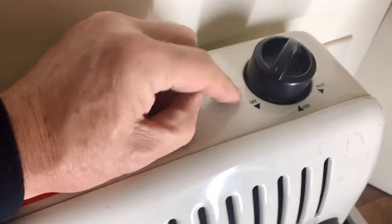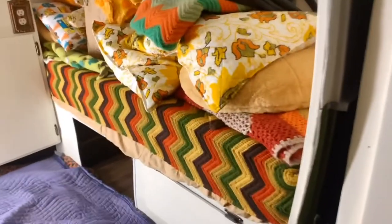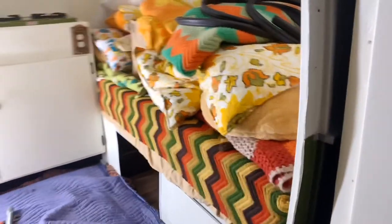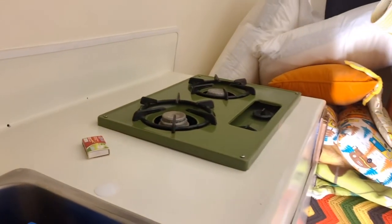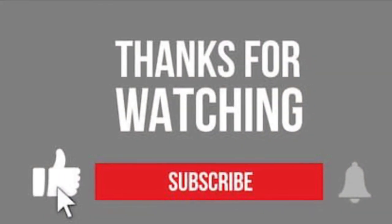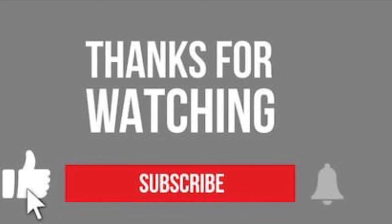Remember, when you turn off your heater and see that the propane is off, don't forget to also go turn your propane tank off at the tank. Because if you have any type of small leak and you don't know it, you're going to lose all your propane overnight. Now that that's done, it's just a few more interior things, but I wanted to make a video all about how I hooked up all my propane stuff. Thanks for joining this episode — please like and subscribe, leave a comment. Tomorrow I'm going to take everything out so I can heat this place up and fiberglass my brackets in place. Take care, everyone!